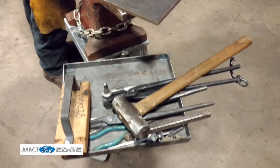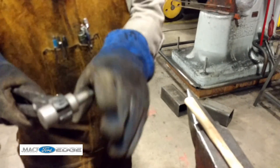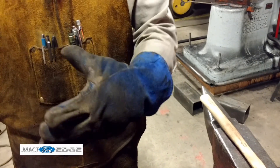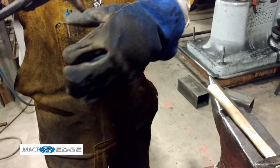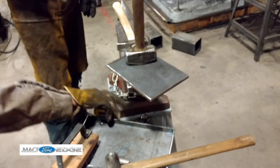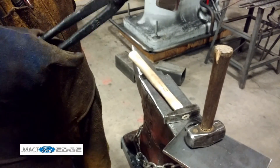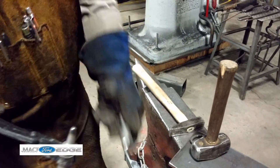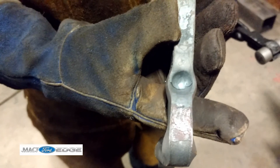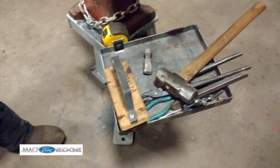Basically all sorts of little tools here. What does this one do? This one is basically a ball fuller — this enables me to draw out metal in 360 degrees. When the metal's hot and I push down here, it's spreading the metal out, creating an opening in the metal — basically a round dimple, kind of like a ball peen hammer effect but in a much smaller area. And this here is a straight line fuller — this is just going to move material side to side, where the ball fuller moves it all the way around. You can just punch holes into it, dimple it, or whatever you want to do with it. I've got other ones for actually making holes.